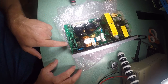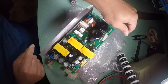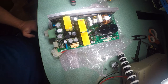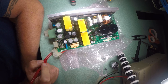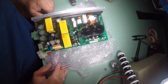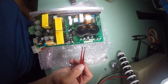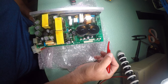Interesting, at one time they had connectors here and they used jumper cables, but they removed that and soldered them on. And it's clearly designed for testing because it has test points right here and here. So there's clearly a diagnostic, there's another one there. It clearly is designed to be serviced, or it would not have test points, and it's got the LED.